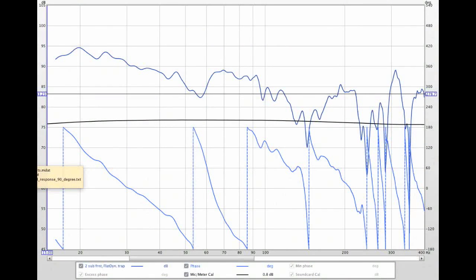Your speakers are very much playing in that frequency range too. When you're looking at a graph like this and you're only playing your subs, you should be looking up to wherever your crossover is going to be — in your case, probably 80 Hz, and a little bit higher. But anything above that, I'm not looking at this graph anywhere above 100 Hz, really, maybe 120 at the max. I'm not looking at anything higher than that because that's not the response — your speakers are starting to play at that point. If you don't have the speakers on, you have no idea what's really happening in your room at those frequencies. All the stuff below 80 Hz and 60 Hz and below — that's what you want to see, and it looks really good.